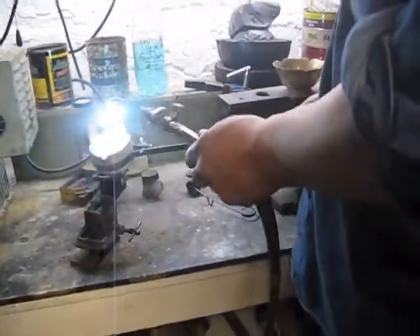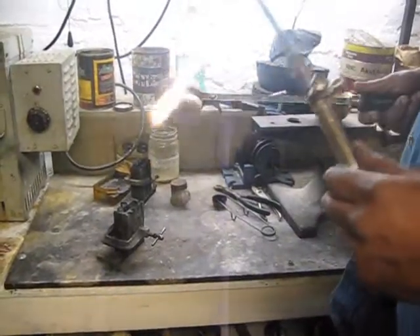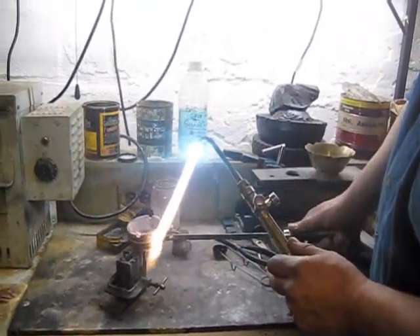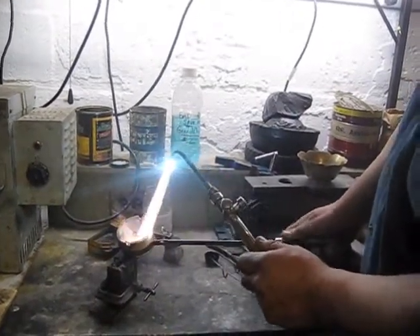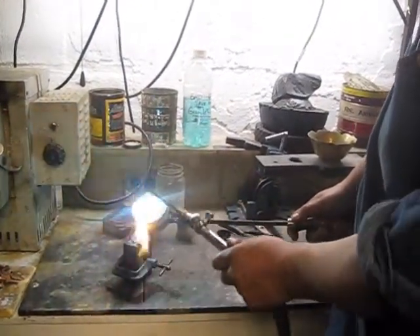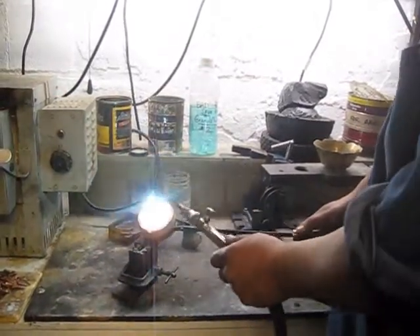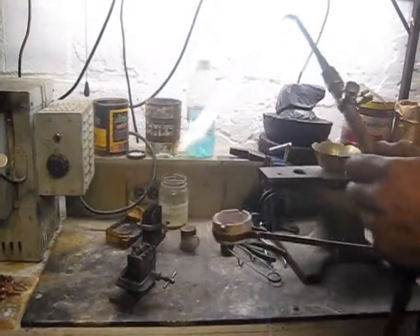So when you do get a chance to pour your metal, you set the ring on the handle far enough from the edge so it's got a place to lock onto. Then you heat up, and when you're pouring, you heat your metal and then the spout as well, so nothing freezes or cools on the way out. Everything is warm between the mold and the crucible, and you keep heating — it should pour one, two, three, just that quickly.